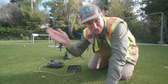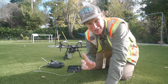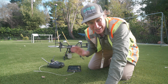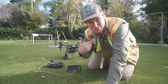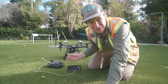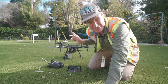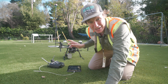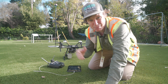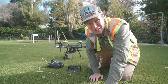If I need to, I can come back, land, change batteries, hot swap, and keep flying the mission. Once I'm done flying all my missions, I'll land, pull out my phone again, and shut off the LiDAR. After that, I go to the base station and stop recording data, grab the data from the LiDAR — it's on the USB stick — take the data from the base station, and proceed to the desktop processing software. Now I'm going to go ahead and get up in the air and start flying.